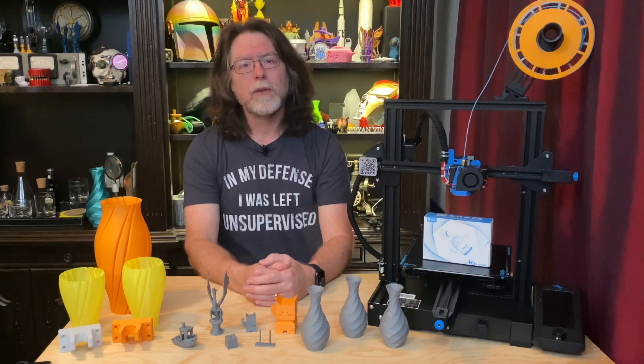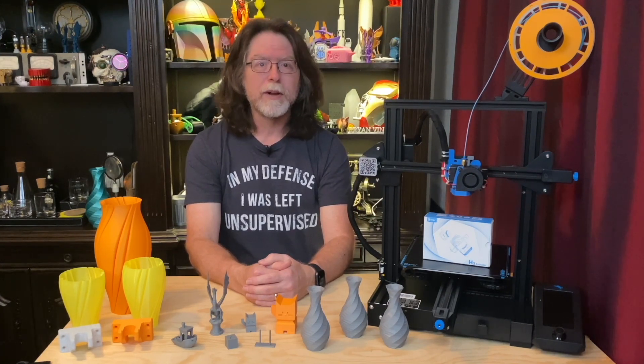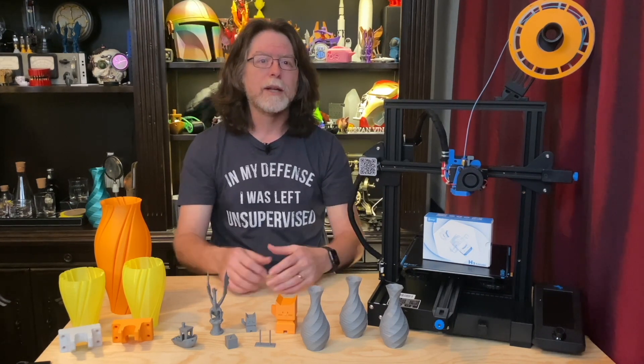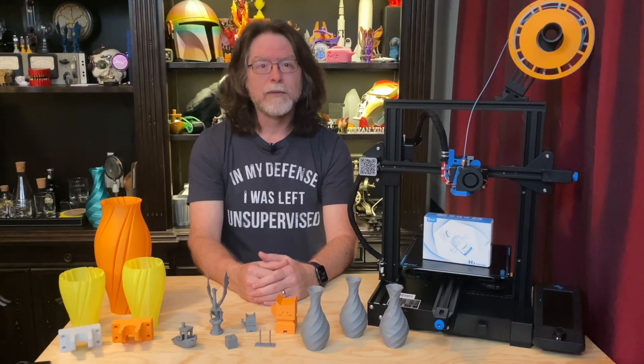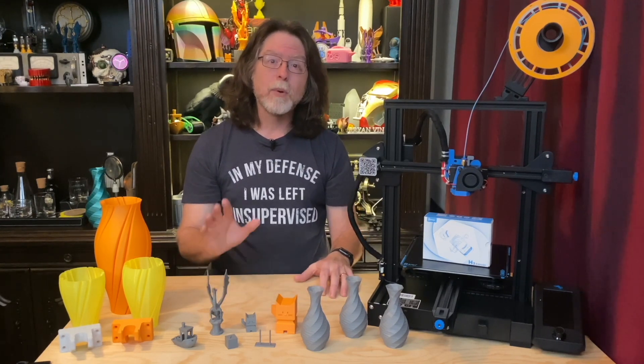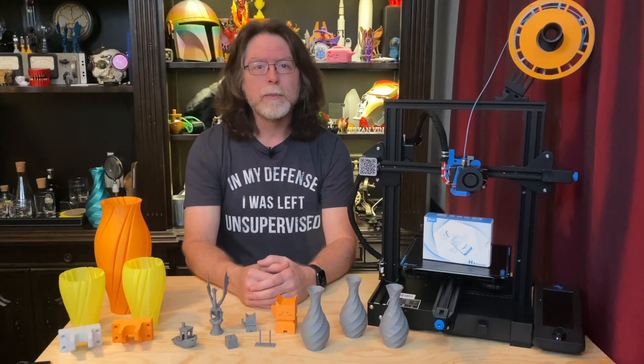So that's the BQ H2 Compact Direct Drive Extruder. It's a DIY project that can give you some pretty great results, but with the included wires being too short for an Ender 3 series printer, they're likely too short for a great many other printers too. If BQ doubled or tripled the length of the wires, you'd probably be able to install this on even a big printer with a 300x300x400 build volume without making extension cables. The STL files from BQ for the printable mounting brackets and parts cooling ducts may not be the greatest, but you can search for other ones or modify existing mounts or design your own. As impressive as the H2 is, installing it is not a project for the faint of heart — you need to be comfortable working with your printer's wiring and good at crimping connectors onto cables. That said, if it aligns with your skill set, it seems to be a worthwhile upgrade. Thanks to BQ for sending this to me to test out, and there's a link to the H2 and BQ site in the description.